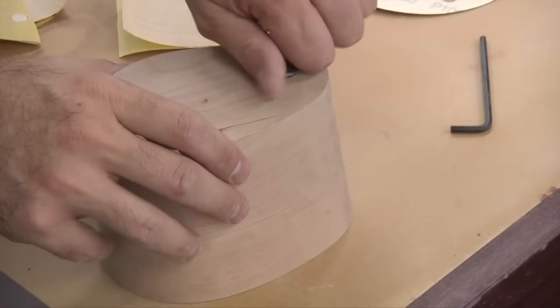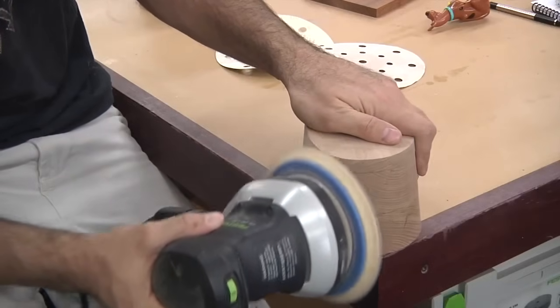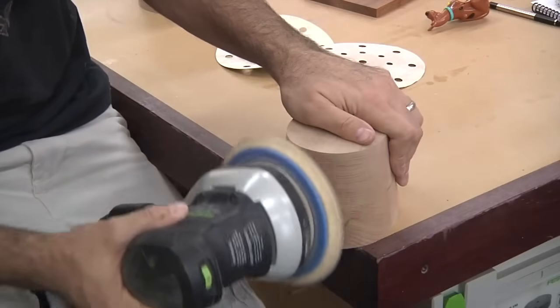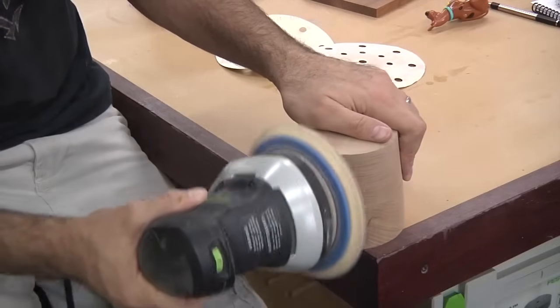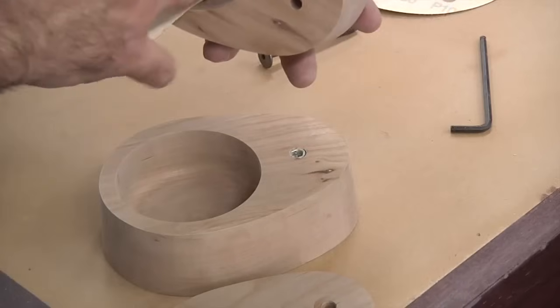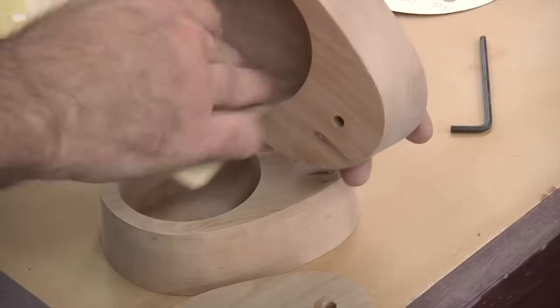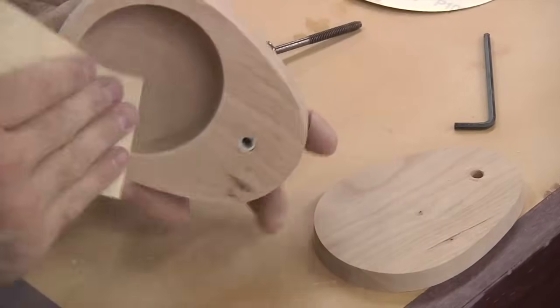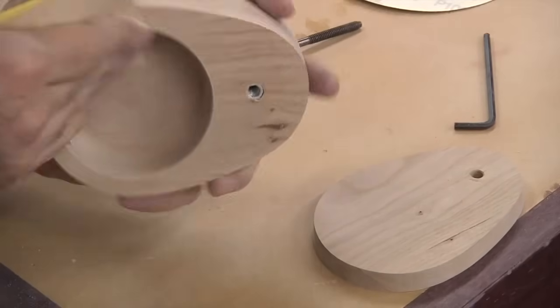With the 3 layers assembled, you might find that the pieces shift slightly, so tighten everything down securely and then give the unit a nice sanding. This last step is really important as it gives the salt cellar its clean look. Now each piece is sanded thoroughly, including the inside dish areas. Keep in mind, these things will be filled with spices or salt, so the bottoms just don't need to be perfect. We'll also break all the edges so that they're smooth to the touch.